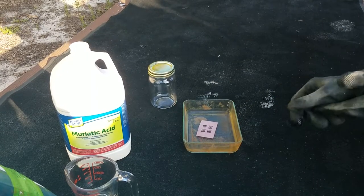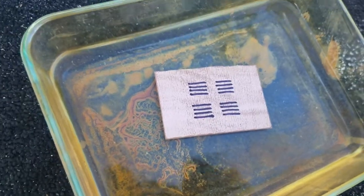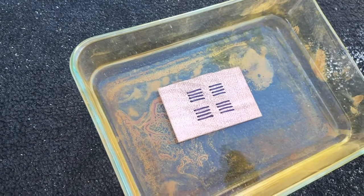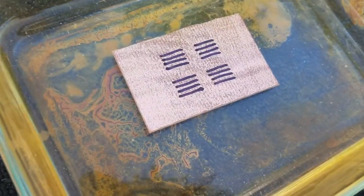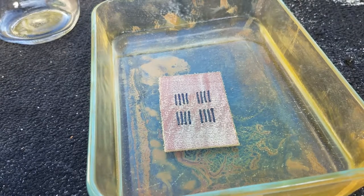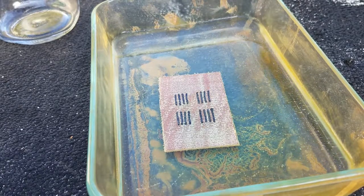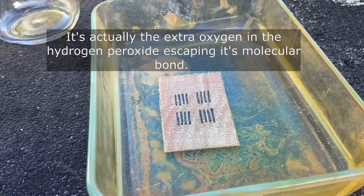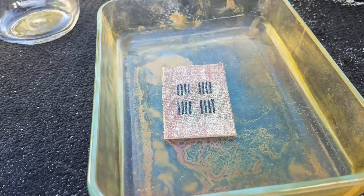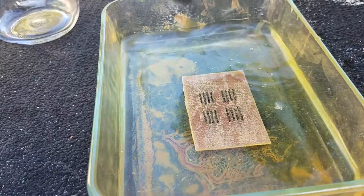You will see in just a few seconds that it begins to etch away at all the copper. It's not a bad idea to shake it to get all the oxidization off the outside. I've seen other people brush over the top with a sponge, but I'm not going to do that — I don't want to wear off the Sharpie. It's been about five minutes and it's taking a little bit longer than I expected, but it's still etching. You can see all the bubbles forming — that's from the copper oxidizing, which is exactly what we want. You may also be able to see that the liquid is starting to turn greenish from the oxidized copper.